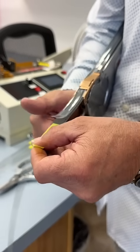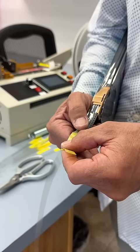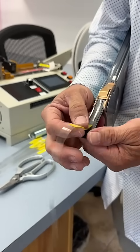We will place this leader tape extender right into the feeder — cover tape onto the bottom — and we will press down, then we will press on the top side of the cover tape as well.